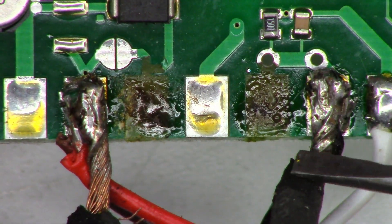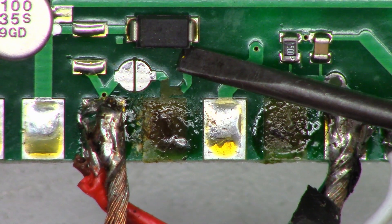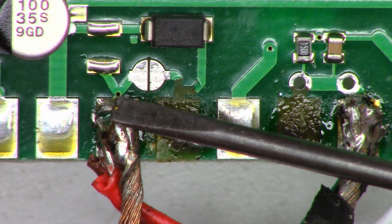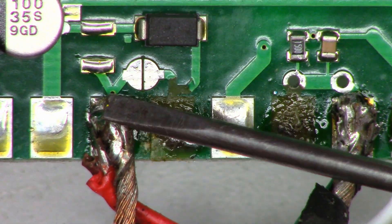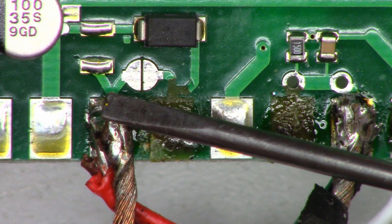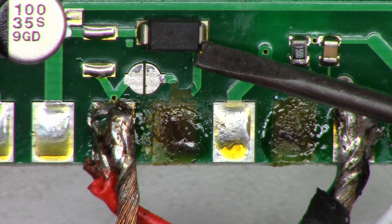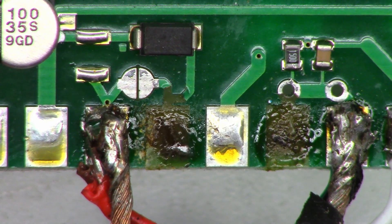If you were to hook up the battery clamps backwards, this diode would not be turned on — it wouldn't conduct any electricity and the unit wouldn't operate, but it wouldn't self-destruct either by trying to charge this capacitor in reverse polarity. So I think the customer, since these two were probably ground and one wire ripped off, just tacked it on over here — that's perfectly fine. But since this one ripped off and goes to the input of the blocking diode, he just attached it to the one next to it, and there's a ground jumper here that's not in use, and it actually blew out that trace. I did an ohm test from this terminal to the ground — the large feed-throughs right here — no connection. So that earth has been blown open right there. So we'll just go ahead and attach those two leads, run a jumper maybe around the back of the circuit board to the ground pad. We'll slice this one, we'll jumper from here to the input of the blocking diode — this will be the new DC input terminal, and I think this unit is going to be back on the road once again.